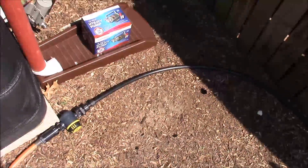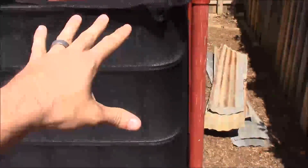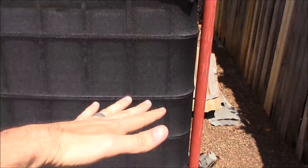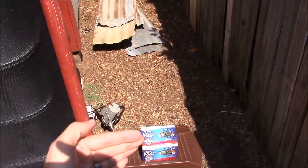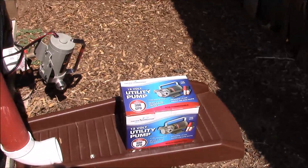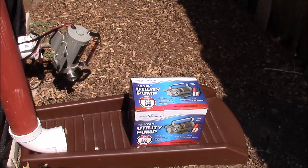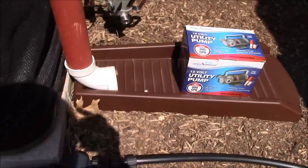What we were missing — I thought that this tote with its 250-plus gallons, the gravity would pull down and create enough pressure to power the system. But it did not. I was quite naive about that. I've learned since then that it did not come close to producing that amount of pressure, so we need to create 50 PSI of pressure.